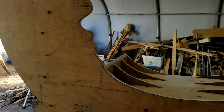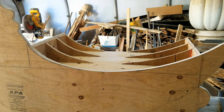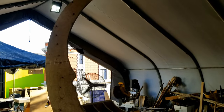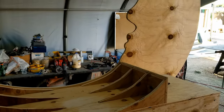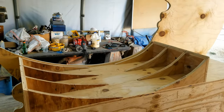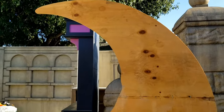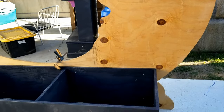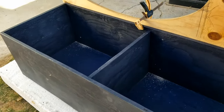One of the things I really liked about this design was matching the seat to the contour of the moon. I cut some plywood framing — it reminded me a lot of making a skateboard ramp. I cut the pieces of plywood and then skinned it with a piece of bender board over the top. The box was framed much like a hope chest, where a lid fit inside.